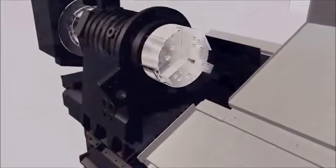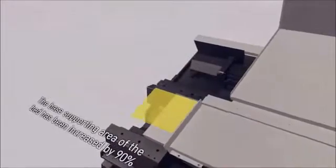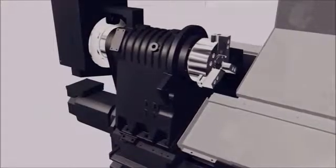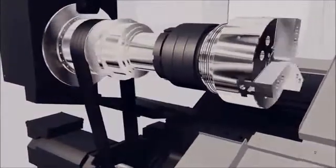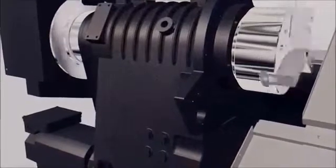Compared to the previous model, the main spindle head surface area has been increased by 90%, but the main spindle overhang has been reduced. In addition, Doosan has doubled the main spindle axis and servo axis rigidity and added a new high-rigidity spindle bearing, improving machine accuracy during high speed and allowing greater accuracy during heavy-duty cutting operations.